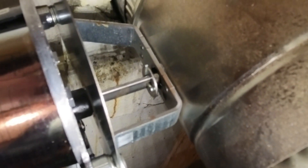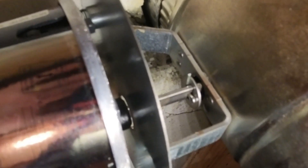There is a shaft here that connects to a round damper inside the smoke pipe. That damper is a stainless steel round damper, and on the end it's got little stainless steel pieces that are cut to act like little fingers, so it will seal up around the pipe but also give it some flexibility when it opens and closes. It's got a molex plug down at the bottom.